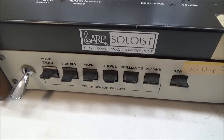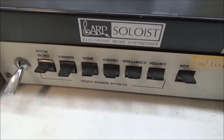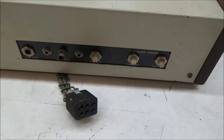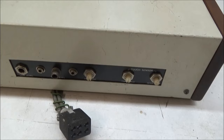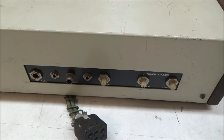The voice selection switches are positioned beneath the keybed. There are fewer than on the Pro Soloist, but some different ones not present there, like piccolo and vibes. On the front, there are switches for the assignable aftertouch functions and the repeat feature — same as on the Pro Soloist. But one switch caught my eye right away: it didn't come from the factory. Then I noticed a cable coming out the bottom with a Cinch Jones connector, the kind used for ARP 2600 keyboard cables. And those extra unlabeled jacks on the back — it's just so Don. If the technology couldn't do what he wanted, he'd go in and make it do what he wanted.